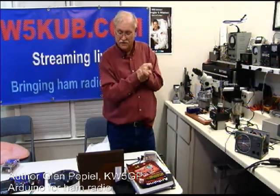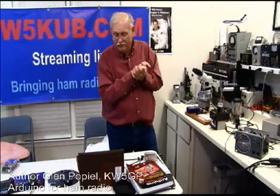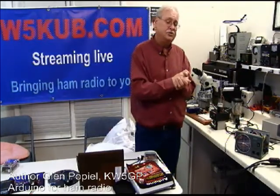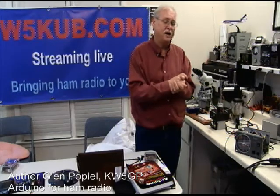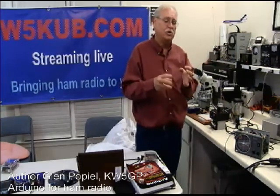Okay, let me answer this one question from 9M2SQL. The Arduino Uno is only a 16 megahertz processor. To do the bit and data slicing you're going to want for an SDR, you're going to want something on the order of a Raspberry Pi or something a little bit higher bandwidth. The Arduino is just not an SDR. It's a controller. It talks to things. It controls things. But when you start getting up into those heavy data calculations, you're going to want a bigger processor. I actually hope that we can get to that later on this evening to show you what some of the higher processor speeds can do. But I really don't think you're going to be able to get a good SDR out of an Arduino, if any.